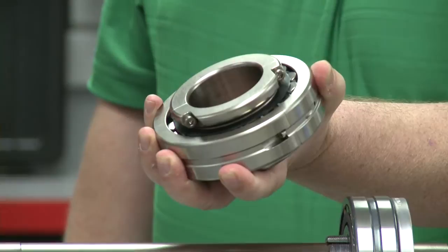Now let's say it is time to change the bearings. One option — the quickest and easiest way — is to replace these bearings with FAG split spherical roller bearings. By using split bearings, you eliminate the need to completely remove housings and shafts in the first place, so the problem of the bearings or housing shifting out of place doesn't even come up. If this is the answer you're looking for, you can view the MI how-to video currently available where Jim and I demonstrate exactly how to install an FAG split spherical roller bearing.